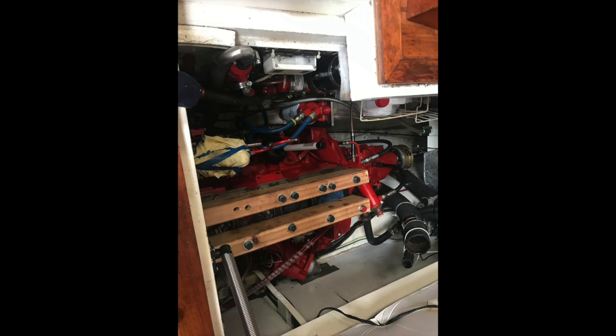So what we have here, we have the blocks of wood across the top of the head with the head bolts in it, and the idea of that was to hold the sleeves in place when we tried to rock the crank on the front with a large socket and a bar. And it turned out that this method didn't budge it at all. As much as I tried, in the end I put a crowbar into the flywheel where the starter motor was removed and did a little bit there, but again that didn't really do anything at all. And soaking it for 3 weeks certainly helped, but the best thing that helped most of all was actually the block of wood, which you're about to see.